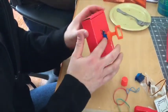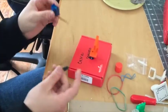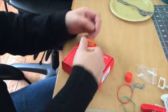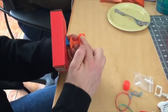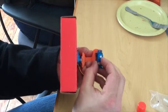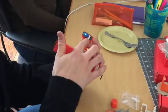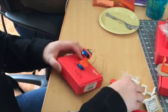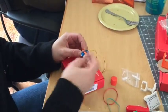Right now, the servo horn should stay on the servo okay. So the next thing we do is put on the face servo that connects to the face. This one just has a hole that it slides into, but it doesn't fit perfectly — as you can see, it's a little bit wobbly and can slide out. There's a little bit of a gap at the top of the hole; that gap is for the wire. We want the side where the gears are offset — that side is the front if we look at the drawings. We're going to use rubber bands; later on we can actually screw these, but this is all a prototype and we'll reuse them until we find the neck position we really like.